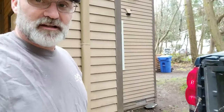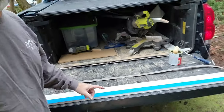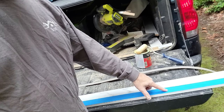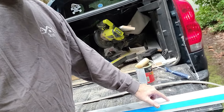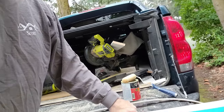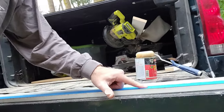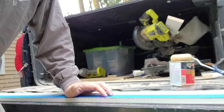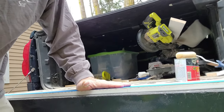So the weather is cold. I have to keep all the doors open because the glue has all the vapors and it smells. So I ran home and changed my shirt - I got to put some sleeves on because I'm so cold. So I'm getting ready to put the top on this backsplash right here. You can see I got some blue tape on here. What this is going to do is protect the front of this when I'm using the router to edge it, and it's also going to keep glue off of it. But we can clean glue no problem with mineral spirits. So I'm going to go ahead and put the glue on this and let that get tacky, and then that backsplash will be done.